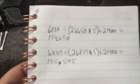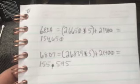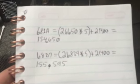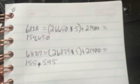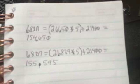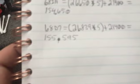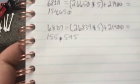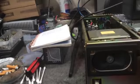Alright. So, what I've done is the top one is the receive. I converted that hex over into a decimal. Multiply the decimal times 5 for the channel spacing plus 21,400 for the IF frequency, and that gives me 154,650. Same situation on the bottom gives me 155,595. So I got the repeater plugged into a dummy load